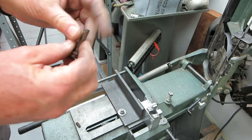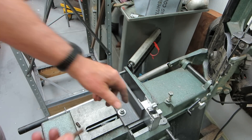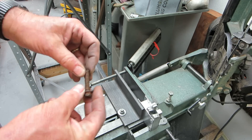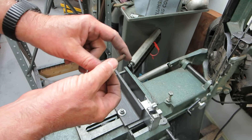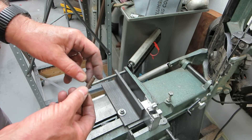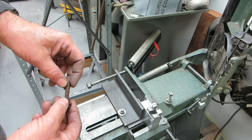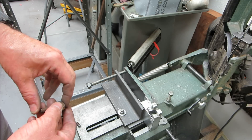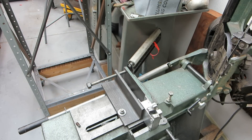The scrap just comes out. You saw on that last one that the head did rotate as it locked in. This design overcomes some limitations of the previous one — the distance from the underside of the head to the cut is what's now regulating it, and I can handle a wide variety of bolt sizes. I don't have anything that's long below a number six, but I think I can go a lot smaller. I'll be putting plans up on the web. I hope you enjoyed it.